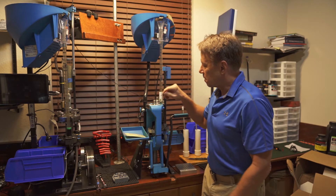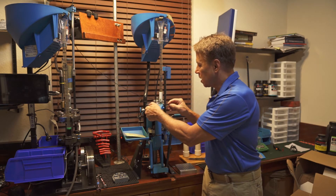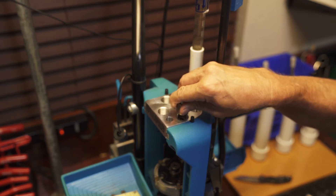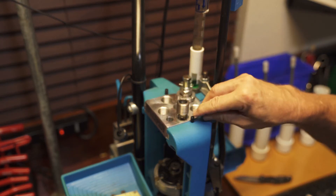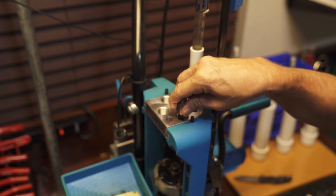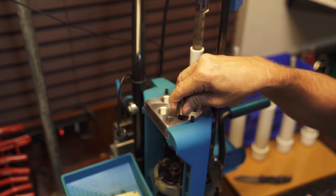Here you can come up and see how much it moves close up. As you can see with the pins, the die plate does have a lot of slop in it, and the goal is to replace these pins with screws, and thus it will be pinned to the top and have less movement and be more stable, and I'll get more precise loads.